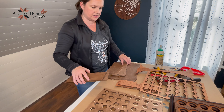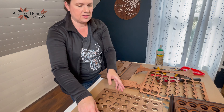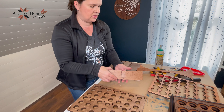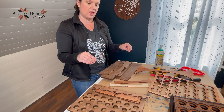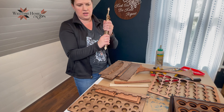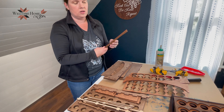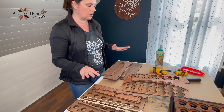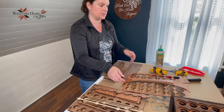So we've got the box, which is going to be the sides, front and back, and the base. We've got the checkerboard pieces itself — we have two. We have the insert that goes in the center; this gives your checkers a place to rest as well as the actual board game to nest in. We've got all the connectors for the board game itself. The files that are listed as decorative — those you should use one-eighth inch wood. You do not want to use one-quarter inch; the file will not work with one-quarter inch. It is only there to cover up your slots — it has no structural integrity to the game, and if you use one-quarter inch it will be too wide and it won't fit in your base. So please keep that in mind.